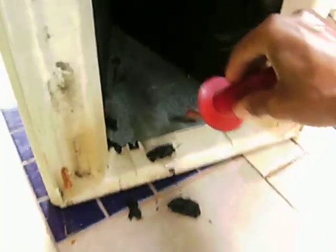Dirt gets all inside your coil, and some coils have to be replaced because there's just so much dirt inside of it that you can't get to. This coil I got here had to be replaced — there was so much dirt in it because of a low quality filter, or in this case it looked like nobody was using any filter at all.